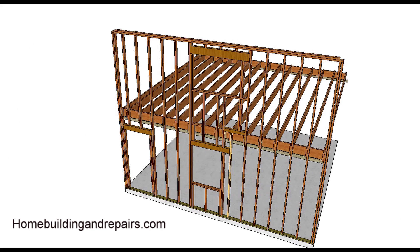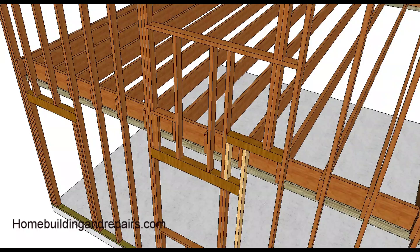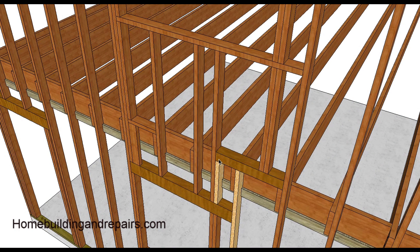Let's take a look at framing a larger opening, starting with the bottom. Here's something you can do: put a 4x4 in, or a 2x4 — that's up to you for the type of support. With a 4x4 and a double trimmer supporting the header above, you're going to be supporting a bit of load with all the weight on the roof. It wouldn't be a bad idea to put something larger like a 4x4 in here to distribute the weight to the floor joist.